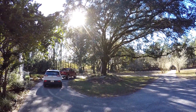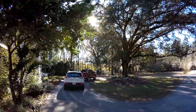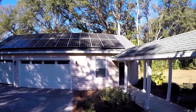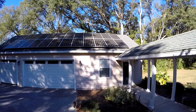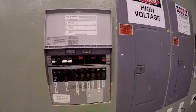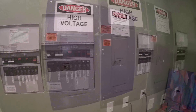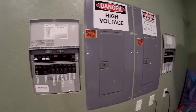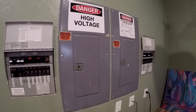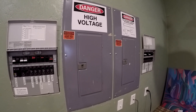It's about 2:30 and you can see that this big tree is blocking our sun — we've got a lot of shade on the panel with just the top corners still hitting. What we want to do now is start cutting back on what we're using. Switch this stuff back over to utility. From about 2:30 on we're not going to run any more big loads — no dryers, no water heaters, no well pumps. We're just going to keep the base loads and probably keep all these running through the night.